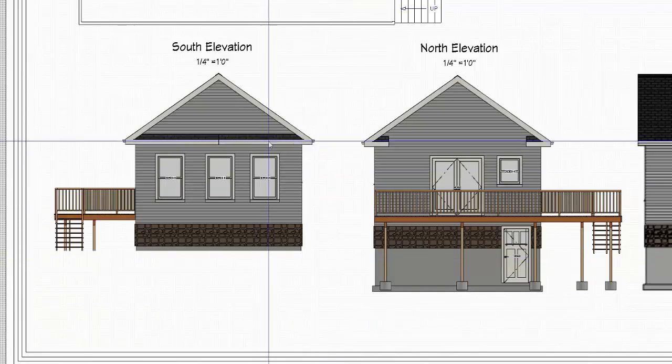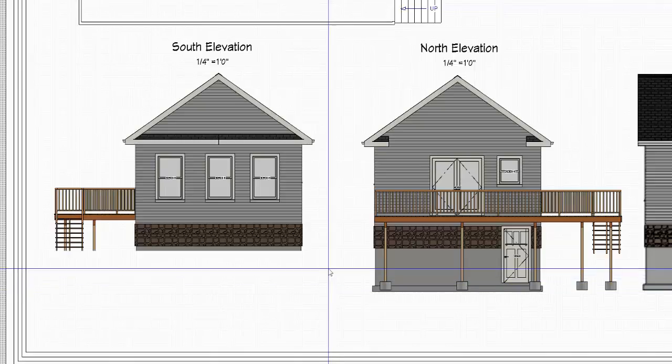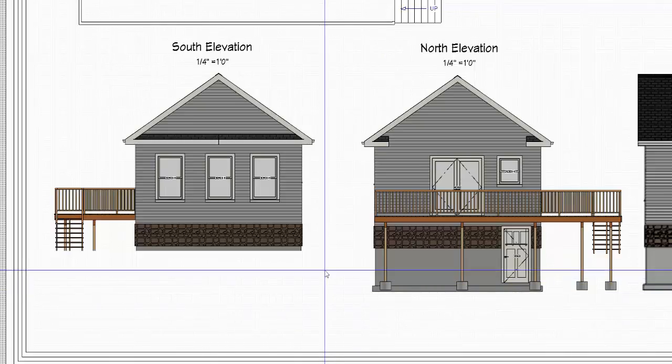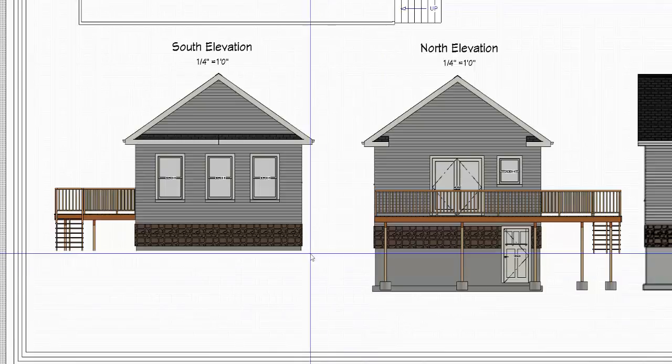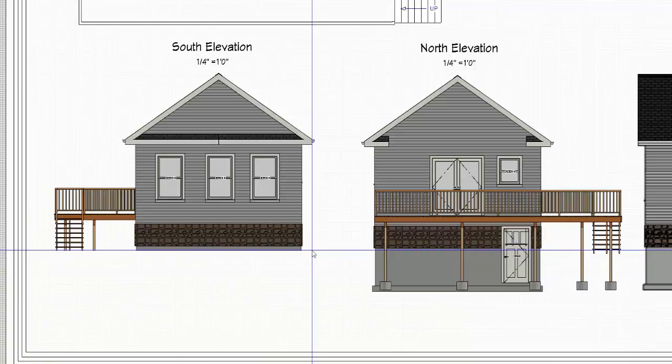In a situation like this, all the trusses are made, even the gable truss, and it's plucked down. The guys either drag the trusses across themselves or use a crane to set trusses. They're not big trusses. Back in the day when I was a strong young man, we would just drag these across, but it is safer using the crane for an hour or two to drag and set the trusses.